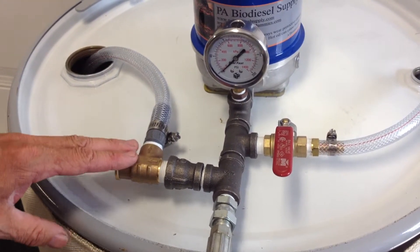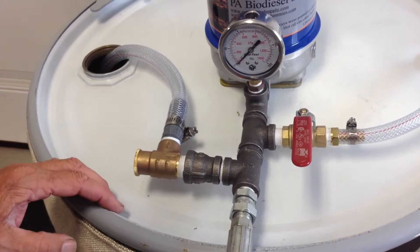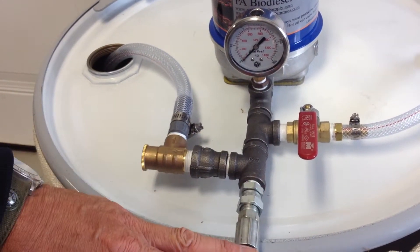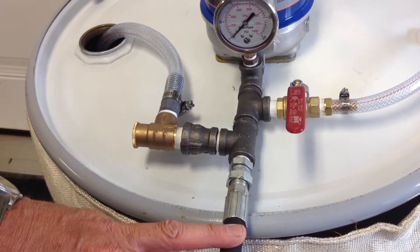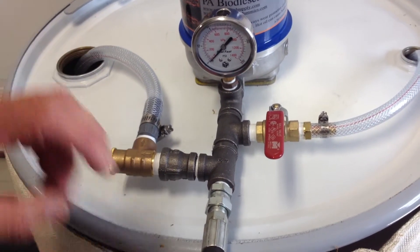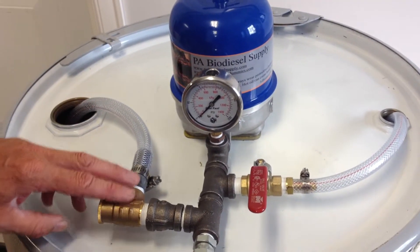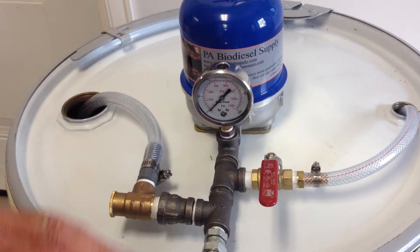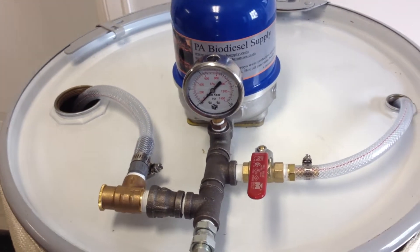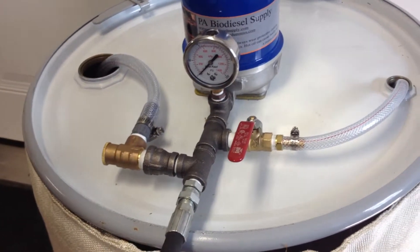The unit is built to freestand. You turn it on at 9 o'clock, you don't need to come back till whenever — it'll run. It's all metal fittings. It's a hydraulic hose that's set for 4,000 psi, 400 degrees. If anything was to clog on the centrifuge, the pressure relief valve clicks open so you're passing the oil back to the drum. Quite honestly, this is simple — it's not Frankenstein science and you don't need an engineering degree.